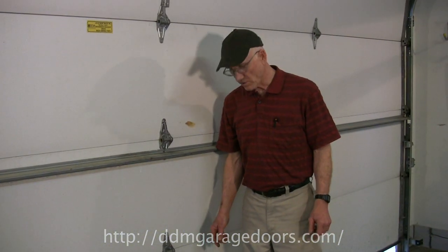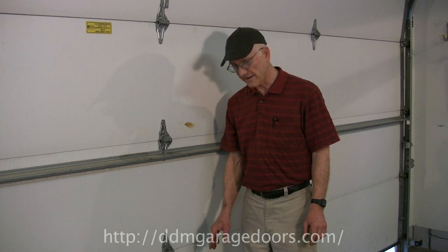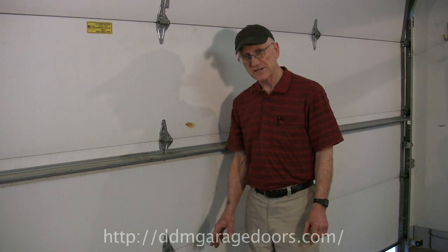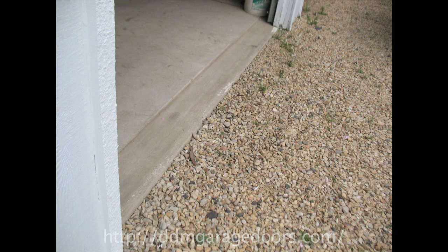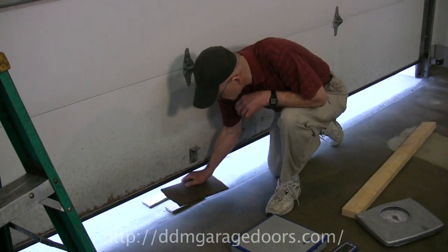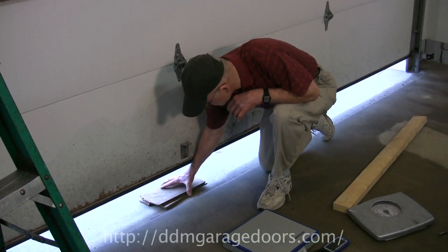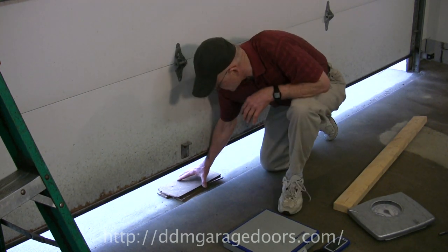In order to weigh the door, we've already lifted the door and we need to put the scale under it. A lot of garage doors have uneven floors and you can't weigh them accurately. We've had a lot of problems in the past with people weighing the door on an uneven surface and the weight not being accurate. So if you have a floor that's uneven, you need to build the floor up. Here we're going to use two pieces of wood and two pieces of masonite to create a level scale surface, mounted center just under the door.